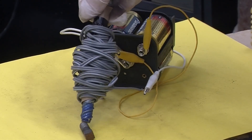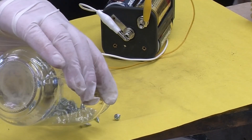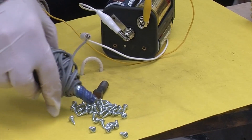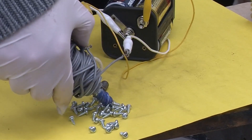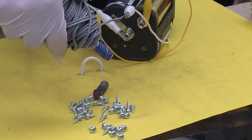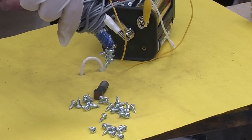And by the way, if you're doing experiments with things like that, there is a good way of testing approximately how strong your electromagnet is. You can use a bunch of small iron or steel items — I've used some little screws, but you could use paper clips or finishing nails. With no electric current applied, there's no magnetism. We add our electric current, and now we can pick up a bunch of screws. The more screws we pick up, the stronger the field. Take the current away and they fall down — just like those great big magnetic crane things they have in junkyards to pick up cars and huge chunks of metal.